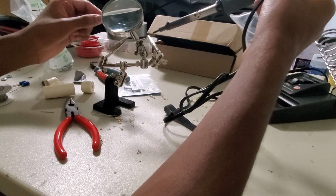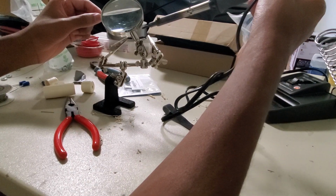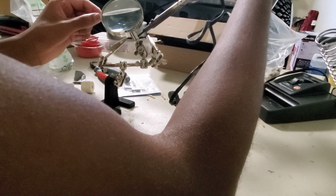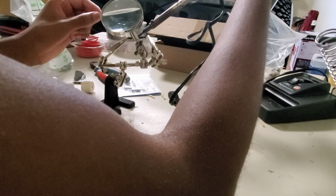Here I'm soldering two 20 kV diodes together. I'll put a picture up to show the configuration. This is the way most fusors convert AC power of a neon sign transformer to direct current, which is vital for steady operation of the fusor.